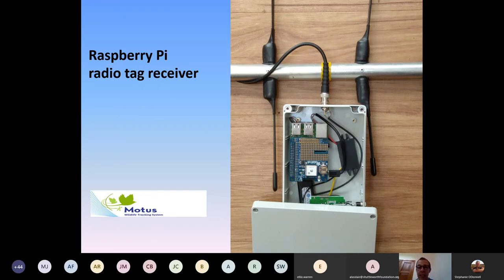Raspberry Pi is another option, more accessible to the non-electronics-qualified person, with so much available online. This is a Raspberry Pi Zero setup with a GPS HAT on top, a voltage regulator so you can run it from a 12-volt battery, plus a timer and fuse to turn it on and off remotely. Things have really come along so that a lot more can be done in the amateur domain.